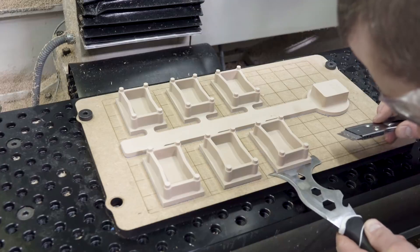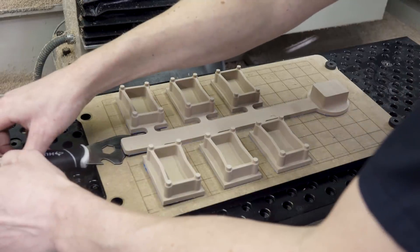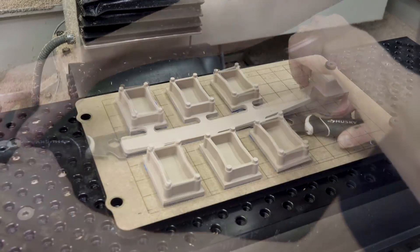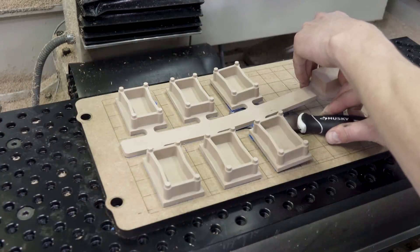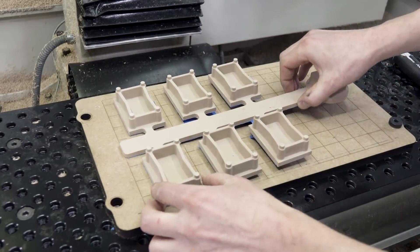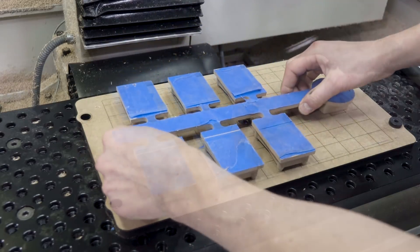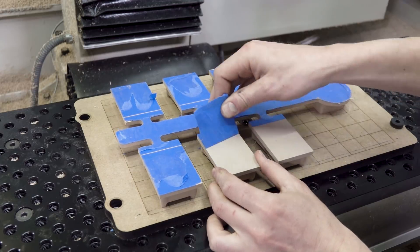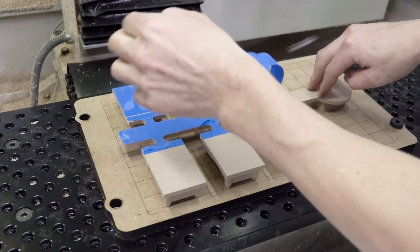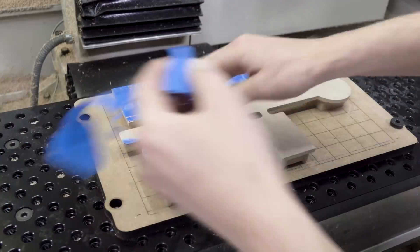Finally, we've got to remove the part from our laser-cut MDF base. There are really three ways to remove superglue: acetone, heat, or a mechanical means of either prying it apart or hitting it from the side to knock it loose. This part's relatively fragile, so we're using a razor blade to lift an edge slightly and then a paint scraper to work its way under there and pry it loose. The trick is to get that paint scraper between or below the tape — and it ended up working out great. We didn't mar our part whatsoever, and it was well worth the trade-off of easy work holding through the risky part of machining the whole thing in one setup.